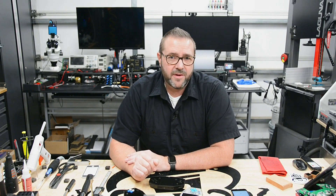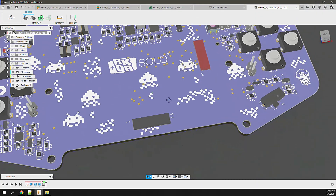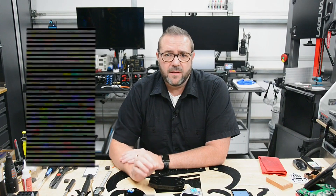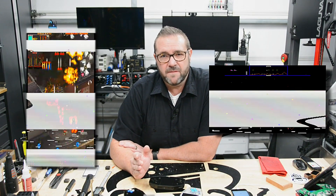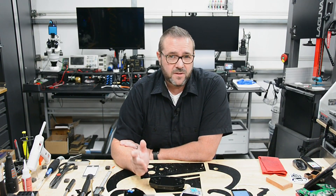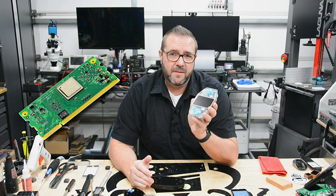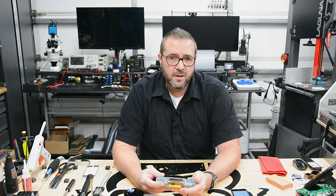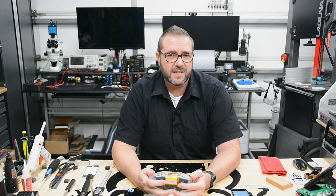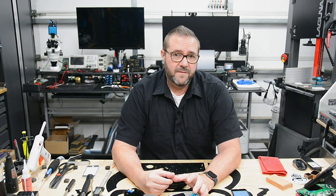The composite video was no longer needed as this build went with a SPI-based ILI9341 display. The 18-pin contacts were wired up to the SPI 0 on the compute module. The footprint was set up with pads for both portrait and landscape orientations — portrait for all the vertical shoot-em-ups and landscape for all the side scrollers. Although this board is hosting a Pi Compute Module 3 Plus, the device will run a little cooler, but I decided to keep the active thermal cooling circuit just in case.